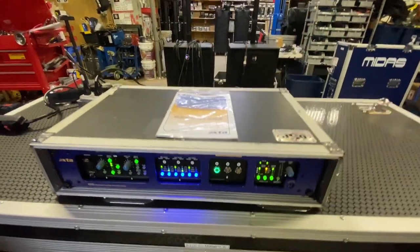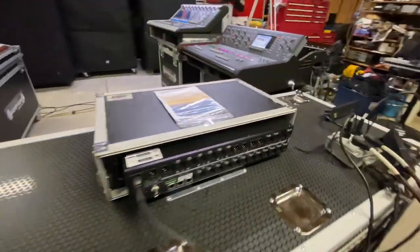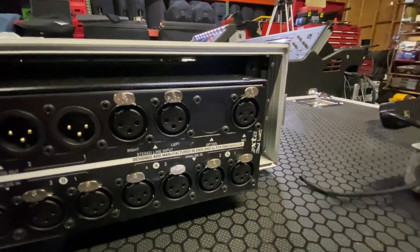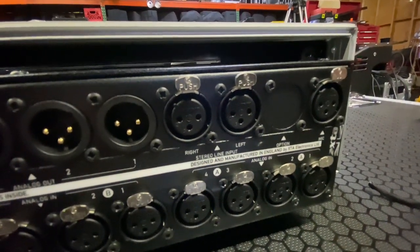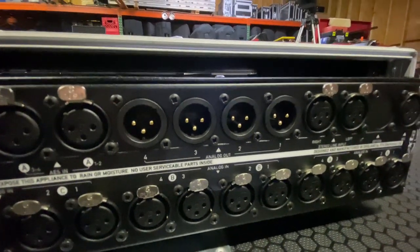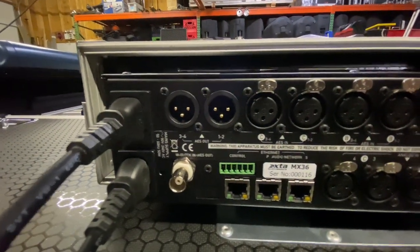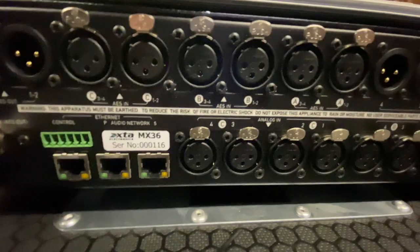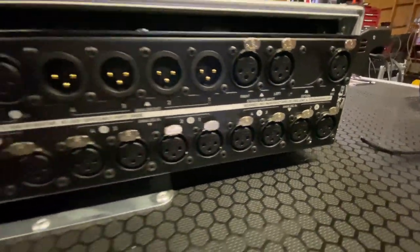Let's go look at the back. We went ahead and unplugged all the cabling, but as you can see it's going to be a mess of cabling for what we're going to do in the next video. On the back, you have your microphone input on the side, then a left/right input for an eighth-inch or CD player. Then you have all your analog outs — left, right, front fill, and sub — then your AES inputs, AES out, Dante on the bottom, analog in, and sources C, B, and A with four inputs for each one.